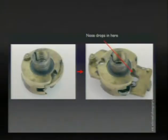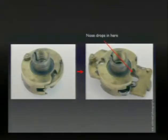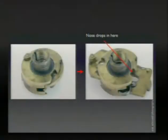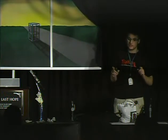So the trick is that the cam is a clever little mechanical spring-loaded device which has this little spring-loaded slider. The idea being that the slider, because of the design of the lock casing, can only slide away from the gate area at one particular point on the dial. And when it does this, the dial is very firmly locked in place. As in, you can't move it even enough to reach the ends of the gate area. You can only move it enough to retract the bolt, which has been cleverly designed to retract in less area than it takes to reach the ends of the gate area.